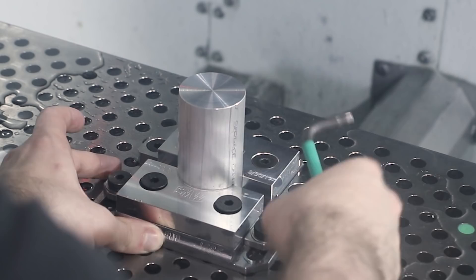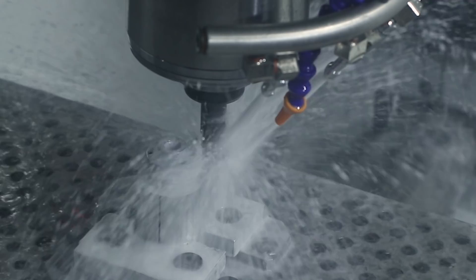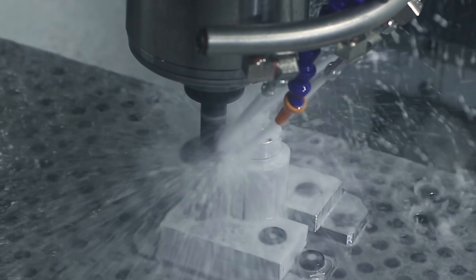For these pivot bushings on the inside, I started with raw 2-inch round bar. Cut soft jaws for those and did them almost as if they were lathe parts — practicing for our Haas ST20 that gets here next week. Did all the millwork on those and then parted them off using a slitting saw. Chamfered the back of those off-camera on the EMCO lathe.